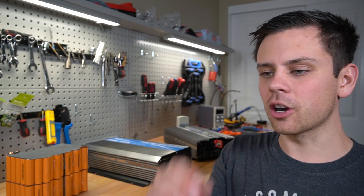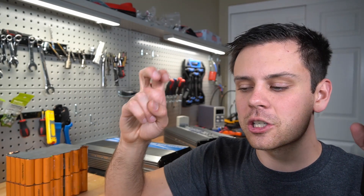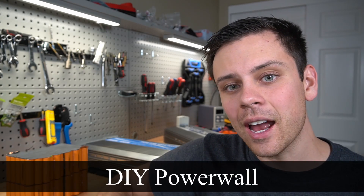This reduced capacity raises the big question of how long these cells will last. There's lots of data on NMC degradation, but it doesn't tell us what happens after 60% of rated capacity. Typically the degradation curves are steep for the first couple thousand cycles, then mellow out — that's when it's considered a second-life storage battery. People cycle it at low C-rates with reduced charge/discharge bandwidth to get the most out of it. The DIY powerwall community does this and uses Nissan Leaf cells successfully.